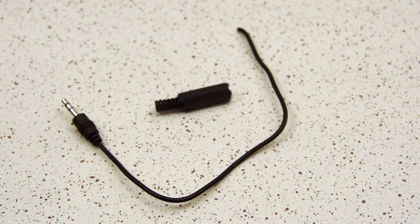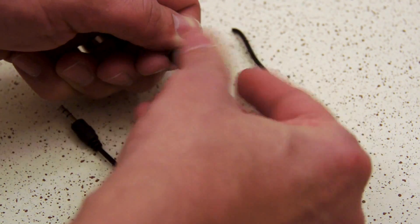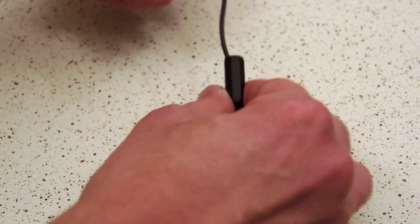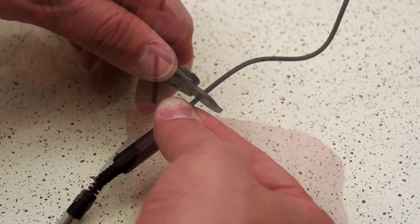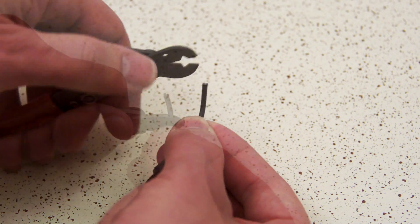Let's get started. Here are your first two parts: your male-to-male stereo cable and your female plug adapter. Notice I've cut the stereo cable in half to get ready. The first thing you're going to do is unscrew your female plug adapter from its plastic sleeve and set it aside. Next, thread the plastic sleeve over the exposed wire of the male stereo adapter, pinch the top of the plastic sleeve with your thumb and forefinger, cut the wire a little bit above your fingertips, then slide your fingertips down to hold right above the plastic sleeve and strip that black wire.